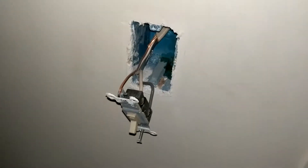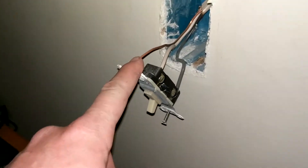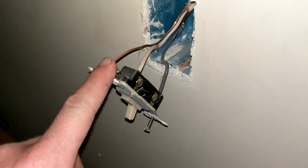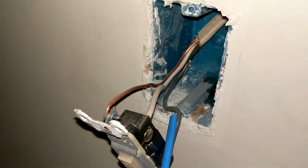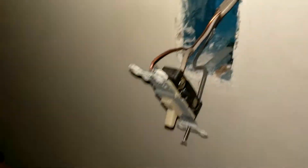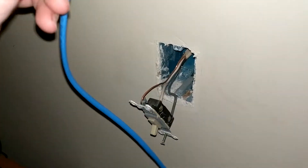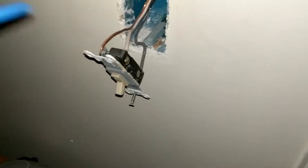When installing these buttons where the light switches would go, the easiest way I've found is to remove the switch so we can put the relay in, then tape our data cable to the Romex cable and pull it up into the ceiling. We'll pull some of this cat 5 cable up enough so there's still some left in the attic.